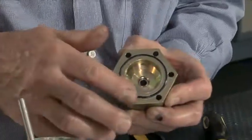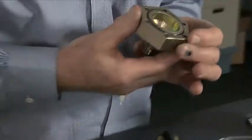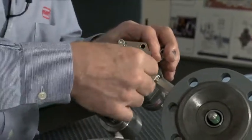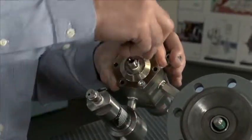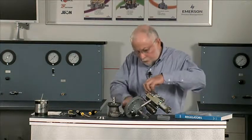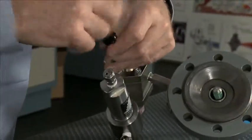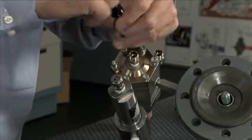The grease we've been using here at the factory is Lubriplate Mag-1. It's a general purpose grease, good down to minus 20 degrees Fahrenheit, so it works out very well in most applications. If we get into something colder than that, we'll probably go to a low-temperature Teflon-filled grease. We're going to put this back on here, draw these bolts up, and bring those down fairly evenly so we're not trying to crush one side of the diaphragm or the O-ring.